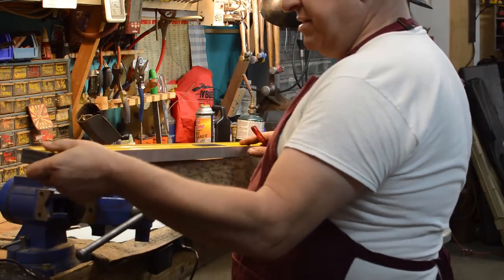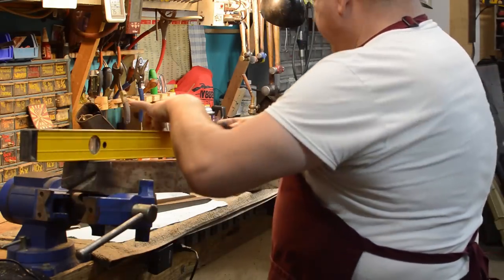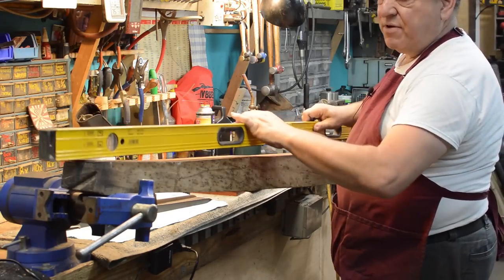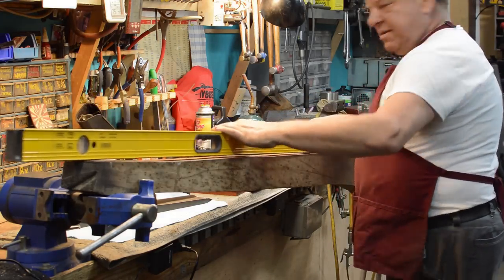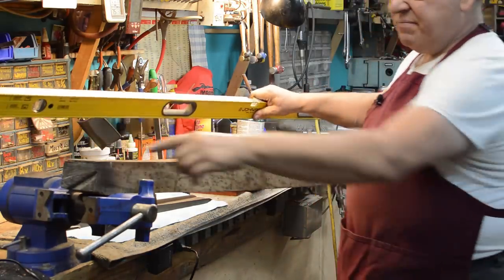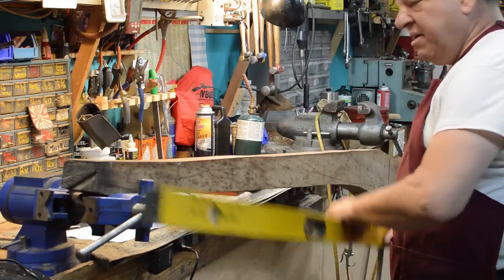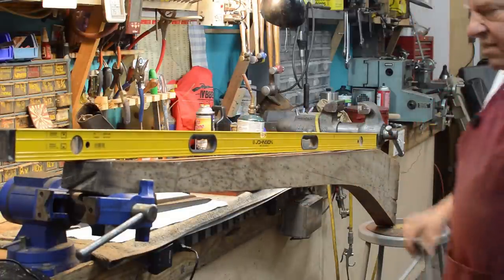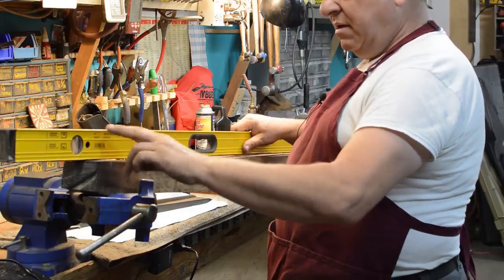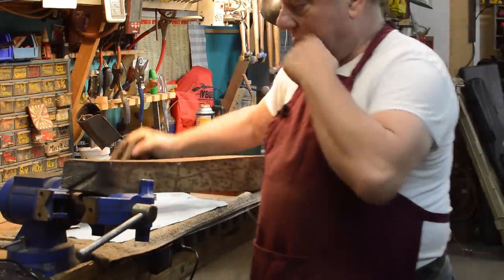We're going to use this bubble level, and I've got this inletting black all the way down it. Well, I can tell you right now, I know the front and the back of this thing are kind of messed up. So all I'm doing now is getting a black mark on this. And there's a very big black mark down here that you can't see in the overhead camera. And there's another one down there. And there's nothing but air in between. So we want that to mostly touch down. Planing anything other than the ends until it touches down doesn't buy us anything.